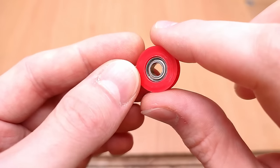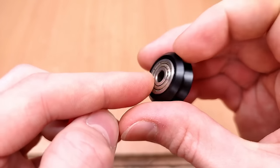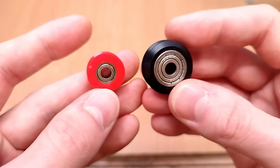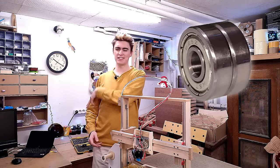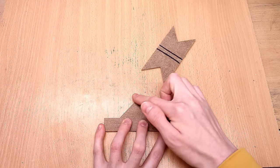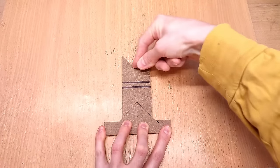You might also have noticed my V-rollers only have a single ball bearing, as opposed to the two you see on those POM wheels everyone likes to use. I did that because I thought, two bearings that close together? What a frickin' waste of a perfectly good bearing. With a 90 degree V-groove riding on a 90 degree rail, it's going to stabilize all by itself just from the tension on the roller.